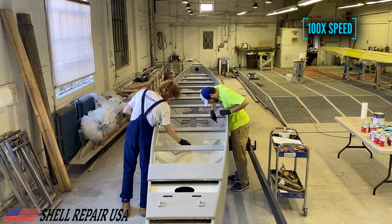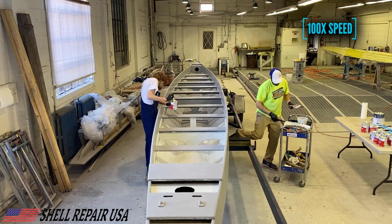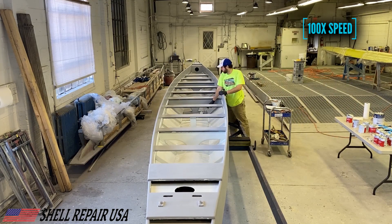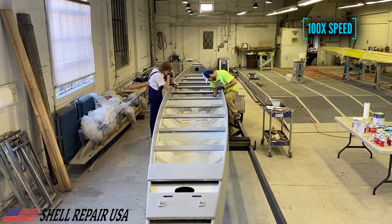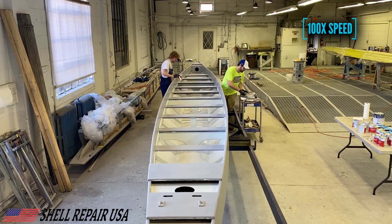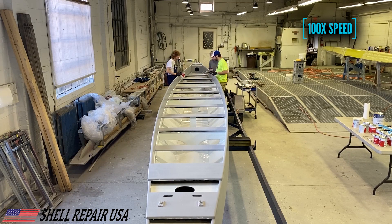We're slowly moving down the boat — unlike the primer, we have to make sure everything is covered and smoothed out before we can move on so it doesn't dry with the improper finish. Basically I'm rolling on as much as I can and then hitting it with a dry brush so that it all flattens out evenly. The paint we're using is Interlux Bright Side and it really flattens out very nicely.